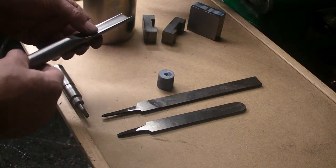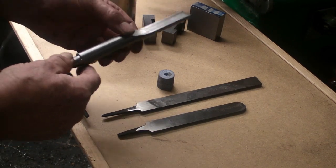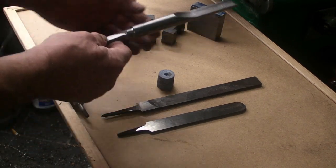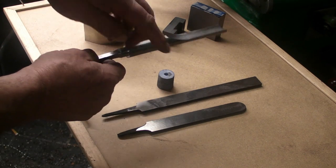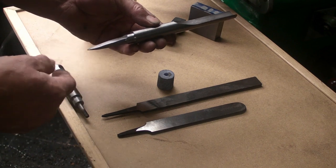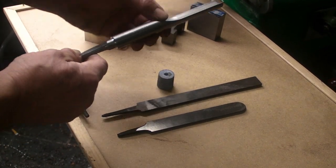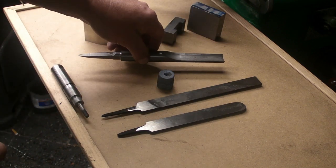I'm going to make a frame. When I anneal these, I just put them on the hot plate on the bottom, but I'm going to make a frame to try and lift them up and sit them on top. I might get a more even heat distribution, but it'll also make life easier when I come to take them out of the furnace with the tongs. So, let's get these in the oven.